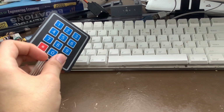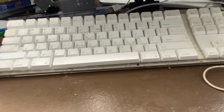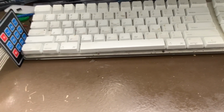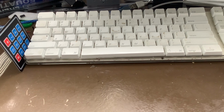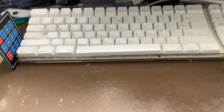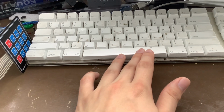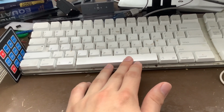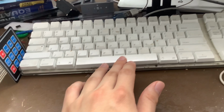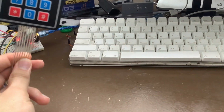Well, you can, I think. Well, that's something I'm not sure, but this code can't handle. And yeah, if I wanted to use a keyboard, I would use a shift register, and that would shift through all the inputs. Or another thing that I'm thinking about doing is having a keyboard that would, when you press a key, enter the 8-bit ASCII value for that key, and then that would only use 8 pins. And with that, I could have 127 inputs. Well, also one for no input, or 0, and that would use basically just a little bit more than these.